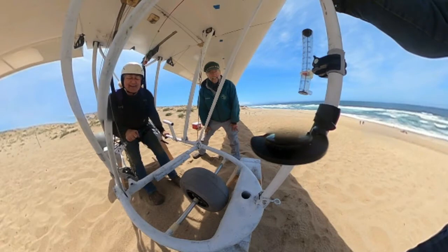We didn't get any video of the first test hop — that's okay, it wasn't much. The second one is actually interesting. We have a 360-degree view camera set up so that we can see my feet and the airspeed at the same time. It distorts the picture a lot, but I was more interested in the data than pretty video. We found out that the takeoff speed is right about 23 miles an hour — I was hoping for 21. I think I can get it down to 21 if I just deploy the flaps a little bit more.